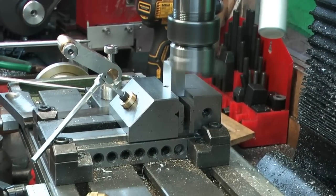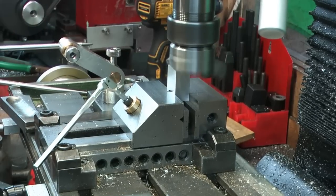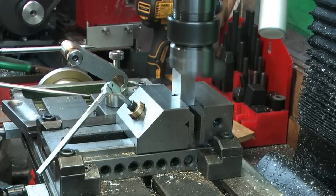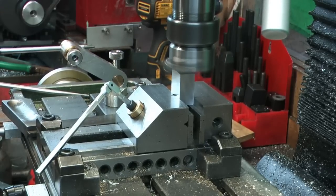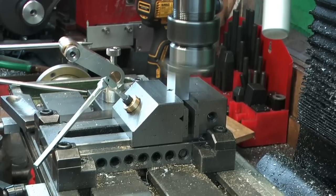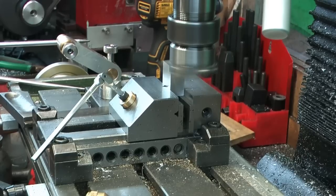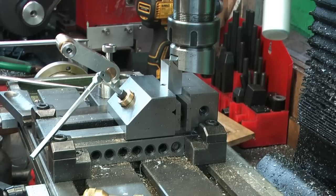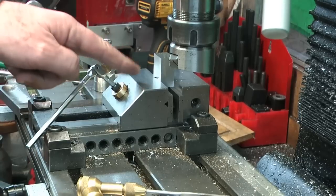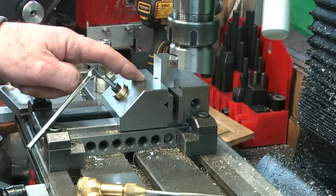Block of aluminium for the carburetor - we've got to start somewhere, so let's start with the body. Last side, all blocked up - six sides, square to each other. Deburr this now and decide on a dimension from the edge of the block where the throat of the carb is going to sit in relation to the block. I need to offer this block up to the valve block assembly and get a rough idea where I want it.